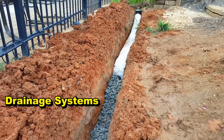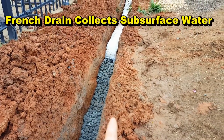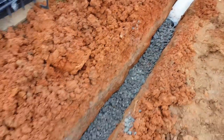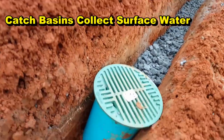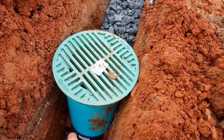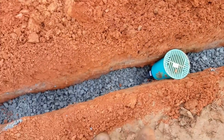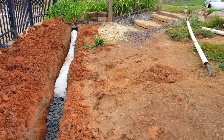On this job we're using a combination of gravel perforated pipe — you can see the gravel — and we're also going to be using some EasyFlow. The reason I'm using EasyFlow is this area where it comes down the steps really has a lot of water that comes through. So we added a catch basin there at the end, and another catch basin right here, and we had to use a riser. You can see that green pipe that comes up from the basin — that's six-inch pipe that we cut to size, which we call a riser. That brings it from the bottom of the trench up to your grate. This system should work really well to protect that swimming pool.